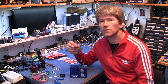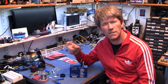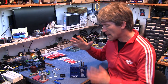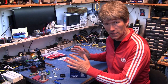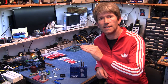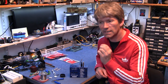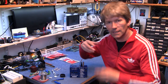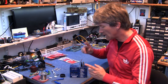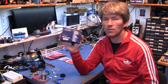Some of the older equipment, such as Moogs, Yamahas, Korgs, I think the Korg MS-20 has S-trigger, which is a shorting trigger. Compared with a lot of the modern day equipment and keyboards, which has a voltage that it sends out when you press the key down. Same as the Eurorack modules, that sends out a 5-volt pulse when it wants to key on and key off another piece of equipment.